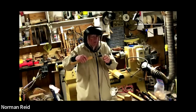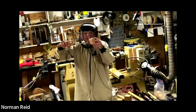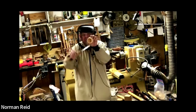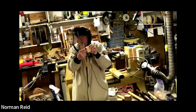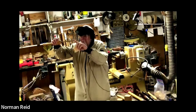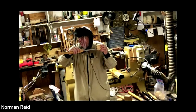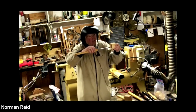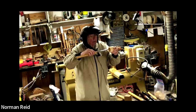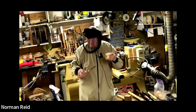Why is it necessary for the cutting tool to be above center when it cuts? The answer is that if it's at center, the top of the, see, this is round. Center is the widest part. If I have the tool at center, what's going to happen to the bottom of the tool, this corner that's here? It's going to cut into the form. So I have to raise the whole tool so that the bottom of the tool is centered, and then this tool is cutting above center, and it's to make it exactly parallel.